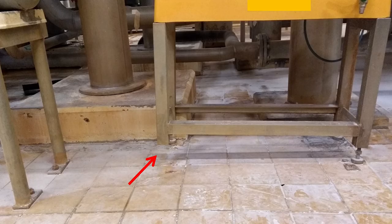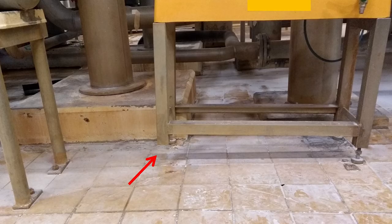In this last example, I thought I had seen it all, but this one is a very bad example of a pump foundation. I marked it with an arrow — there is one support missing underneath this foundation. Because of that missing support, it will give a lot of vibration and torque, and also tension to the suction line and discharge line, which can cause them to break. A very bad example.